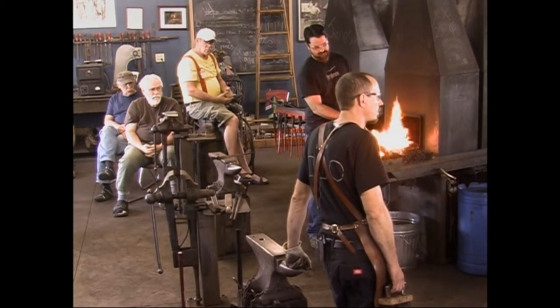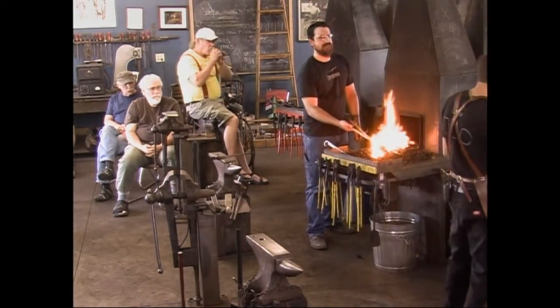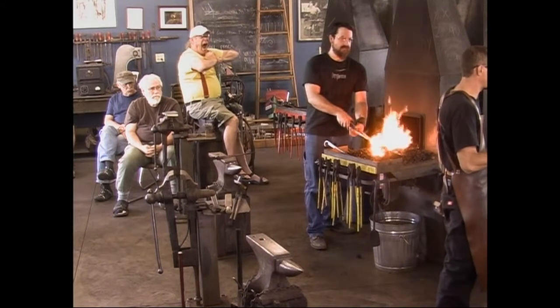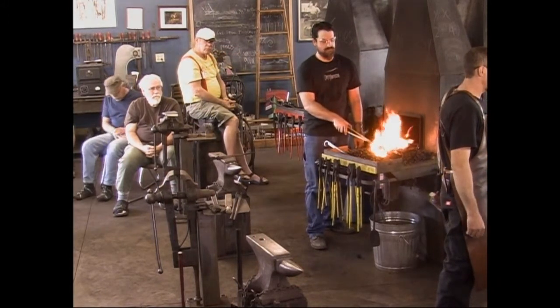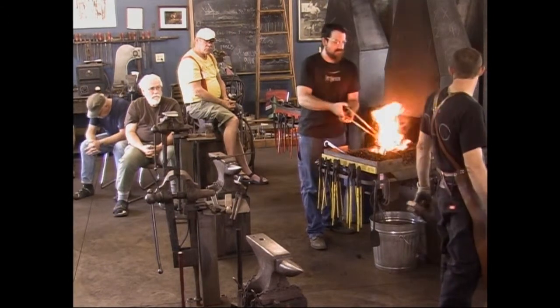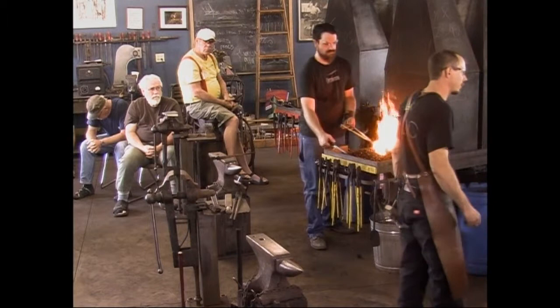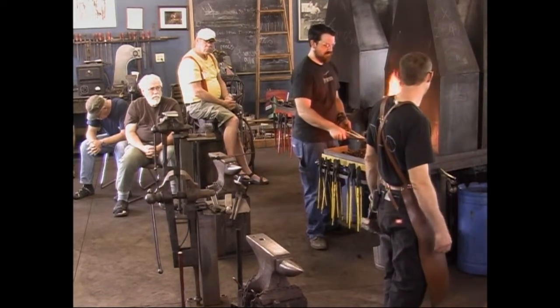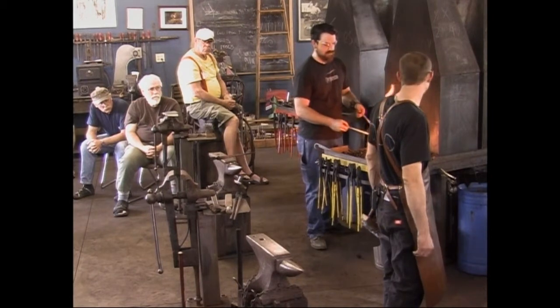What fill rod did you use? It's just regular mild steel. It's the same as regular MIG wire, ER70S-6. Yeah, that's what I used. I tried using stainless steel in the past, and I tried using H12 fill rod when I was welding this H13, and then one day I was in a hurry and just grabbed what I had. So far so good.